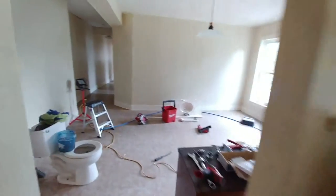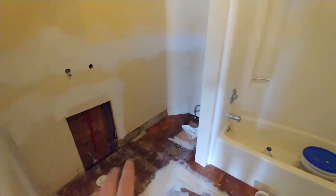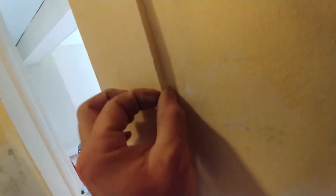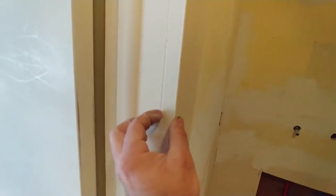In the bathroom, the subfloor patch is done and I need to add some trim. This room was originally matched lumber then drywalled, so the door was trimmed when it was just matched lumber and then drywall was added on top. That means the trim only sticks out about a quarter inch despite being a three-quarter inch or seven-eighths board. Because of that, the baseboard they added when they drywalled down to the floor is just a thin quarter-inch strip to indicate baseboard. I popped it off thinking it went back to the wood, but it wasn't — and that's actually cement board, not drywall.